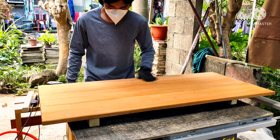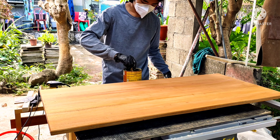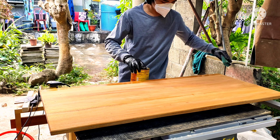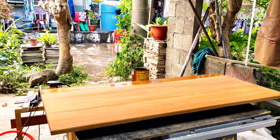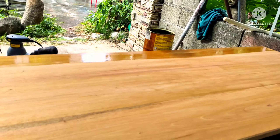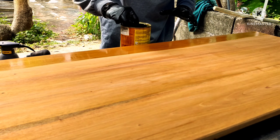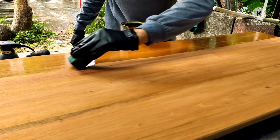Now that we're done with our first coat, before we apply the second coat we must sand between each coat. I use 400 grit sandpaper here just to remove the slight roughness so that you can apply your second coat smoothly, which will result in a very smooth finish. A quick reminder: always stir your polyurethane — never shake, always stir before using.